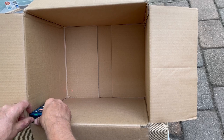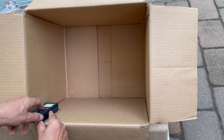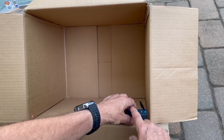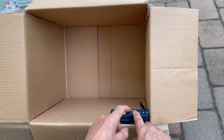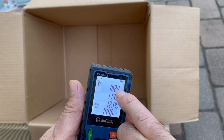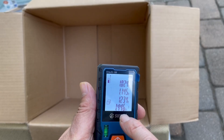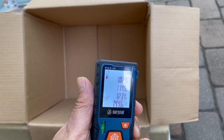I'm going to take it from this edge right here, then one more measurement from this side — you can see the laser light over there. Push that over there. This is all in feet: 1.02, 1.14, 1.23 — and it's come up with a cubic measurement of 1.446 cubic feet.